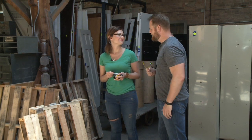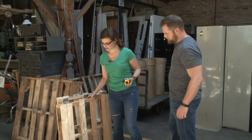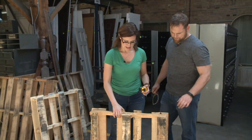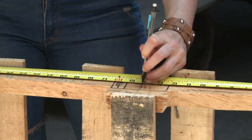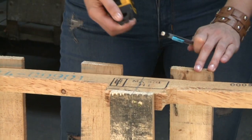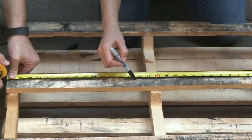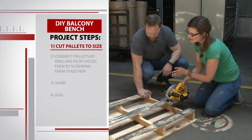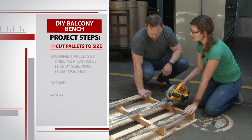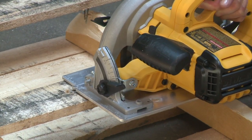The first thing to do is measure. Pull the pallet up and measure right across the top to make sure you're cutting right in the middle, since you'll need to stack two halves. You'll need to make two cuts because the saw isn't deep enough to go all the way through the midpoints — make one cut, then flip it over and get what you missed on the ends.